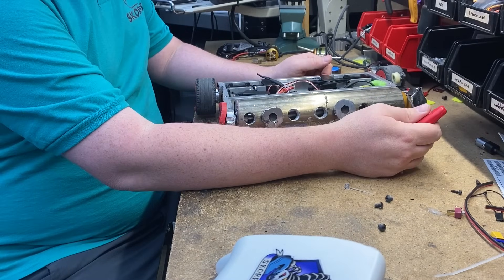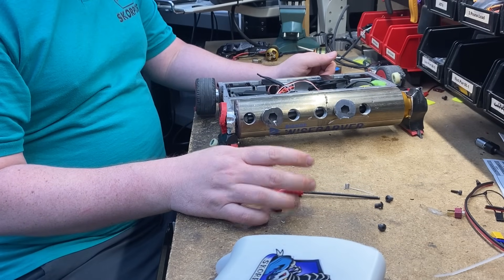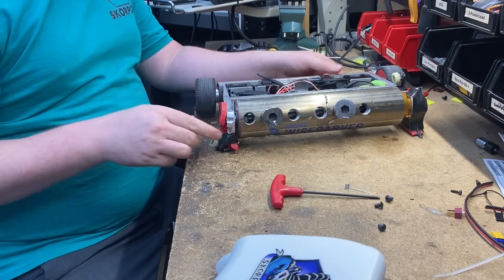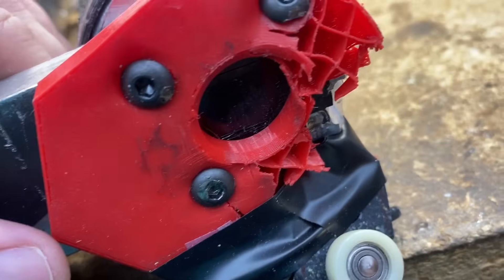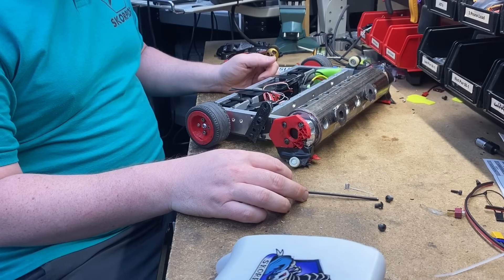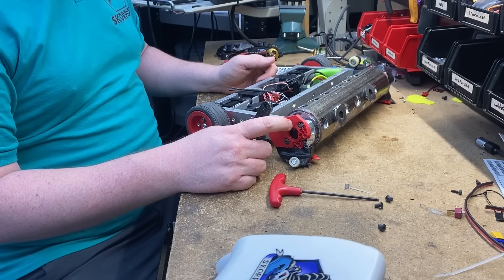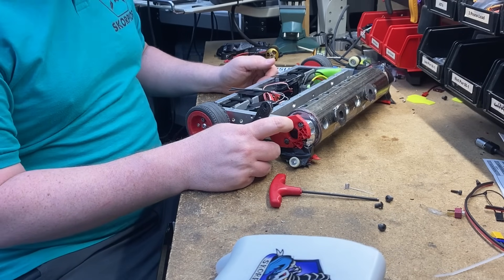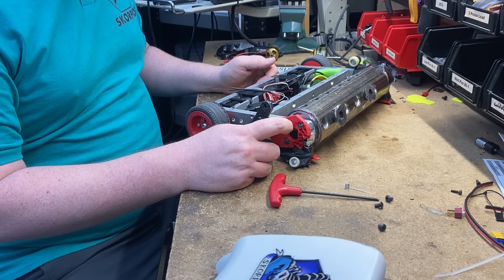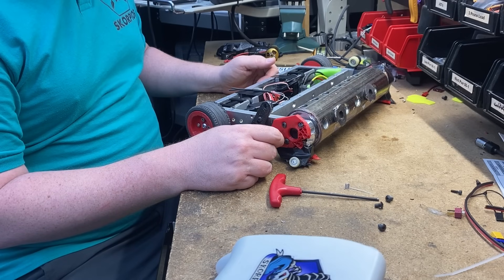These front skids had eight to seven pounds on them — because of the weight of the motor, the weight of the front rails, the weight of the front piece. And something I did not give credit to is TPU. In my head, I was thinking of it just as a plastic that would slide, like Delrin or UHMW — two other very common plastics we use in robot fighting. But this stuff does not slide — it has traction. Some people even make tires out of it. Putting six pounds directly over two TPU skids was definitely the downfall of this robot.